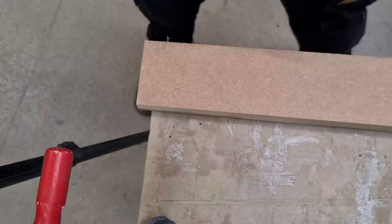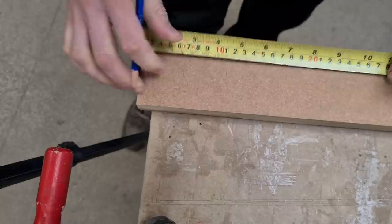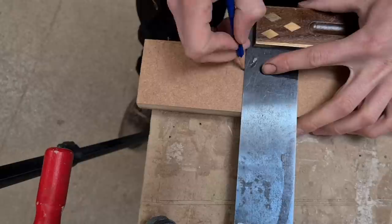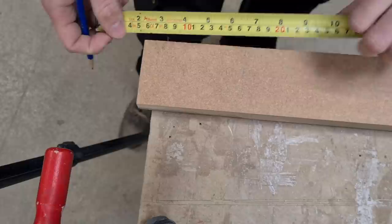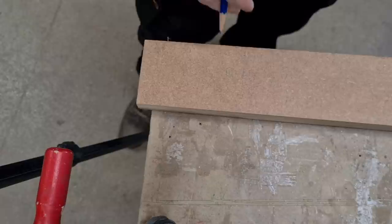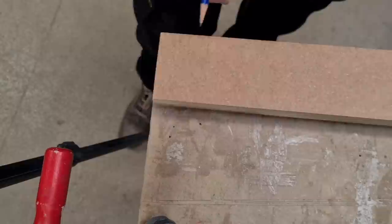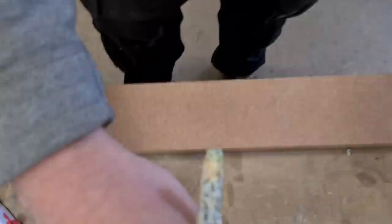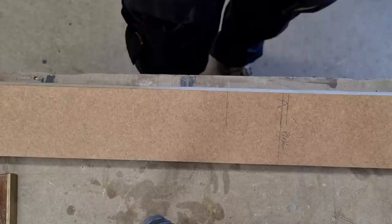Let's set that out. So we've got 95 to the top of our skirting. Then we want to come up 18mm from that point to our frame. So we can square that line over. That's the top of the bottom rail or sill of our frame. We can then mark out that piece of timber at 60mm. That is the position of the bottom of the frame here. So we can now measure from this point here to this point here. This one here, which is the top of the frame,